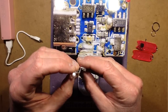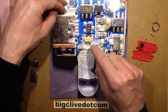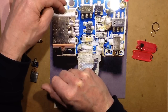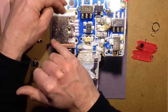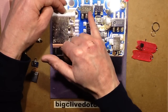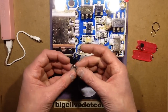There's a little decoupling capacitor just for general protection of the circuitry from glitches and spikes. This transistor is being controlled — ultimately from this chip here, which is the charge control chip — and it's driving the blue LED via a 470 ohm resistor. Fundamentally, that's about it. It looks fairly cluttered but it's all functional: it's got the charge regulation, the charge current regulation, the control processor — the little control chip that does everything — and then off-board, it's got the lithium protection. So it's all very functional.